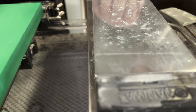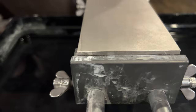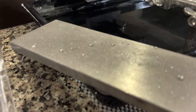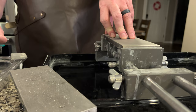There's a whole other video on the differences between electroplating and resin-bonded stones. With these CBN plates, Hans has taken CBN particles — which have an octahedron shape, basically like a four-sided pyramid glued to a four-sided pyramid — and electroplated them in nickel. The nickel melts through electricity and these CBN particles become embedded inside the nickel, sticking to the electroplate.